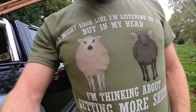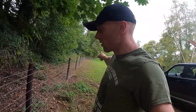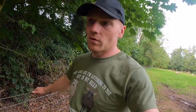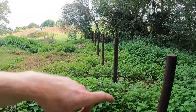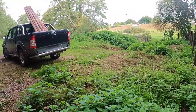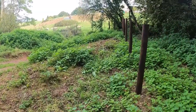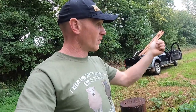I'm going to show you what we're dealing with. That's my new t-shirt today - my birthday present. Remember going that way we've got about 400 metres of high tensile fence, all in with the electric on top - not on yet. Down this end, however, we've just got posts. That's mainly because if this floods, it flows that way and the last thing I wanted is to build a sieve. I still want the top wire to be electric because that's what will bring over the supply from the other side if we run it off mains, and then it will carry on down that 400 metres.